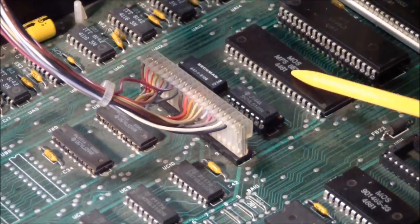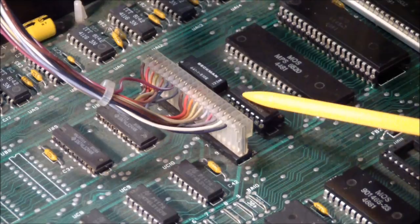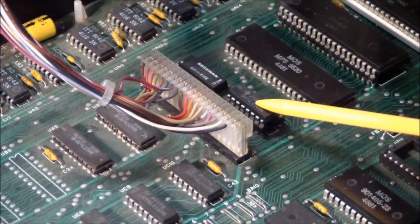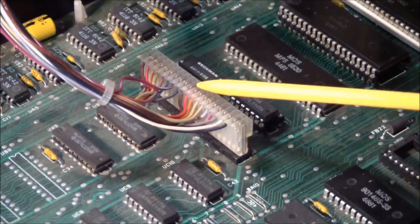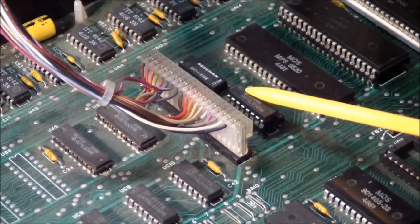This chip that was driving the keyboard matrix had strange waveforms that weren't really extending down to ground. And so I diverted and I replaced it. I pulled this chip out, socketed it, and put a new one in. The waveforms now looked a lot better, but I wasn't getting any key presses. I was checking the return lines, and there weren't any key presses coming back. So, well, I'll fix something and I'll probably benefit from it later, but it didn't change anything. Holding down a key didn't do anything because obviously there were no key presses coming in.